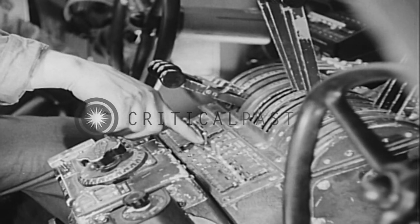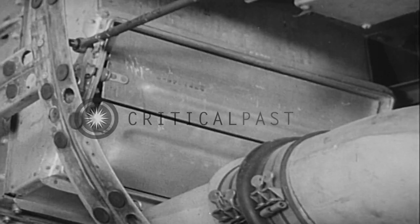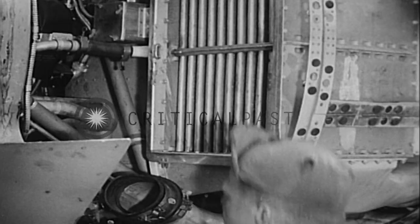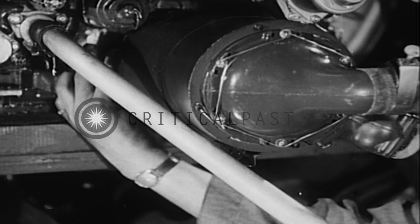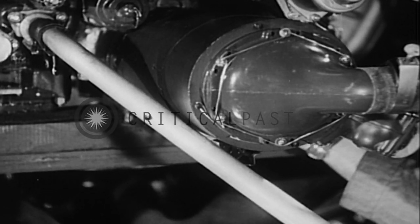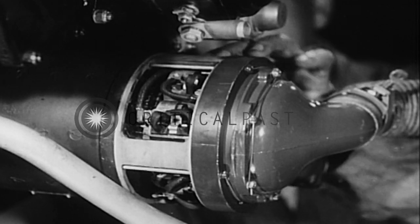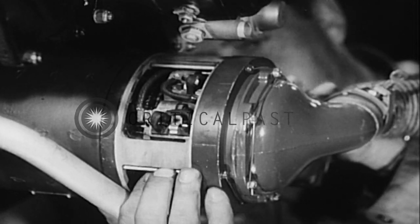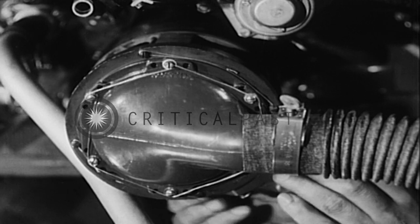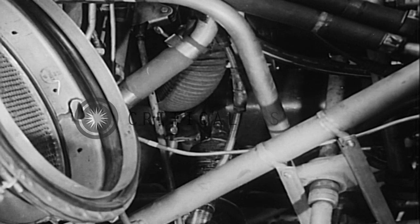In the cockpit, Moore throws the switch for the intercooler shutters, which are checked below for proper operation. They operate perfectly, so on to the next job — the all-important generator. The generator is the heart of the airplane's electrical system; it sends out the life-giving power through the great electric network of the airplane. Chandler first checks the generator for security of mounting and makes sure the brushes are in good condition. They must not be excessively worn or sticking in any way, and their connections should be firm and tight. Chandler further checks to see that no faulty seal has allowed oil to seep into the generator — just a little oil can do a lot of damage. The cooling blast tube connection should be tight. He checks it and finds it okay.